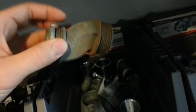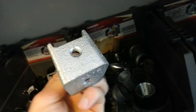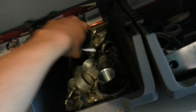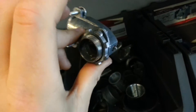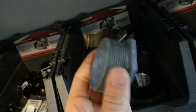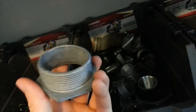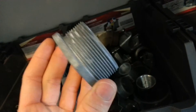Here are some more offset nipples. This is a beam clamp — that's for attaching to red iron and dropping down all-thread. This is a three-quarter flex 90. And this is what is known as a chase nipple — it's for if you have two boxes side by side, you can just put that right through and thread it up and you're good to go.